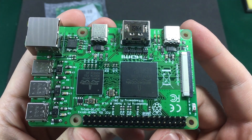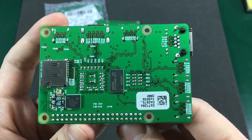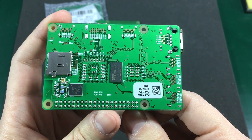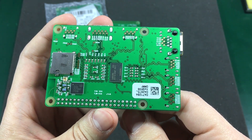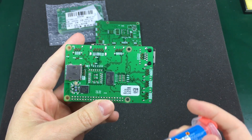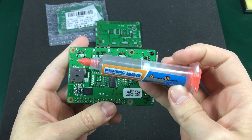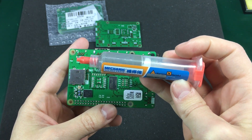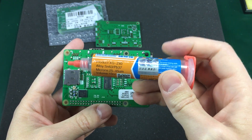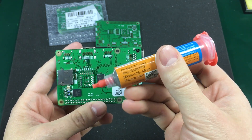As you can see, I got some pretty decent results. The through-hole parts like the connectors were soldered with some lead-free water-soluble solder wire, which made cleaning very easy — I just cleaned it with some tap water and a brush. The solder paste I used for the surface-mount components is this one from eBay; it's pretty popular, doesn't leave a lot of residue behind so no cleaning was required, and it's really inexpensive — about 3 or 4 dollars for this syringe.